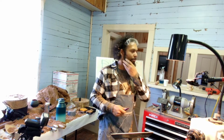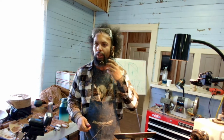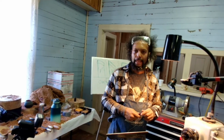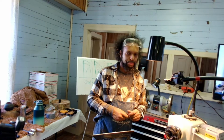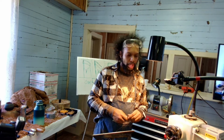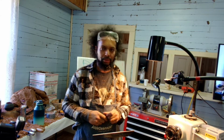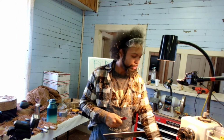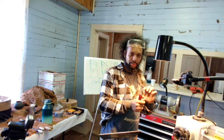Wow, I'm really decorating myself nicely. Oh, goodness. Yes, sir. You stop it again, probably a 16th of an inch from the top. Yes. You can go back to the other side and get that end grain, so as not to tear out the inside of it. Yes, that's typically something that you can do. Yes. I noticed on that one, you stopped it. Yeah, I stopped. So I didn't take that all the way out. There's a little bit, so it's kind of sharp at the top.